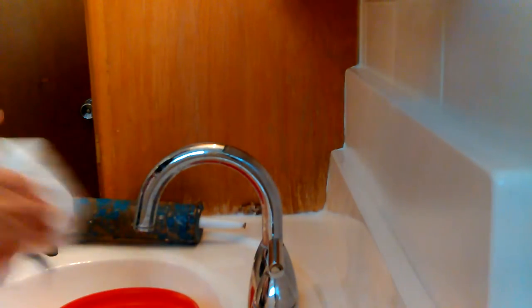I've got a nail - if you didn't already know that, anybody that's ever done any caulking should already know this. You know those caps they put in the tube - they're great, but the thing they don't do is stop it from drying up down the tube and then you've got to dig and dig and dig. So actually just a nail or a screw does me better service.